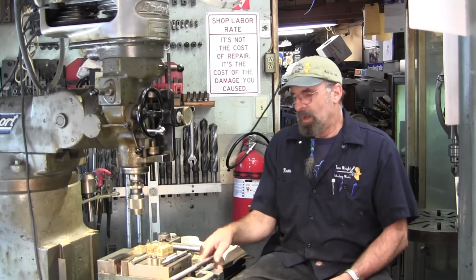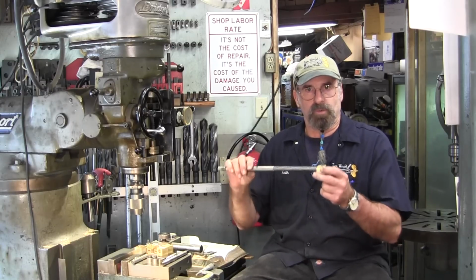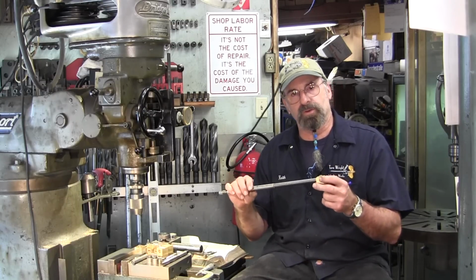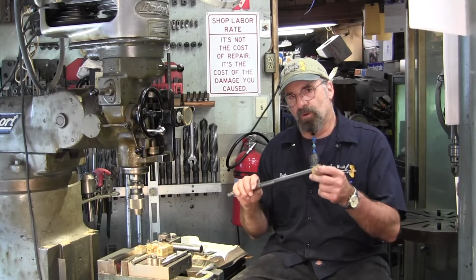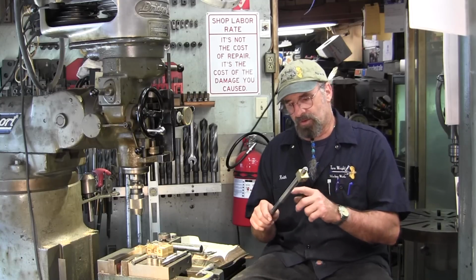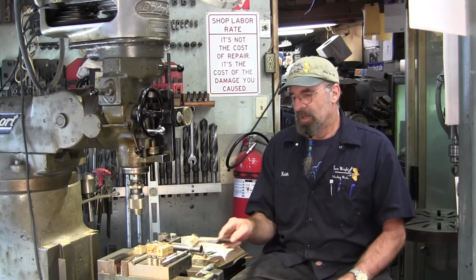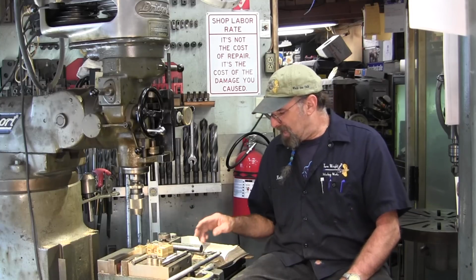Now, of course, when you're making nuts and lead screws, that's why you do both together, and you turn your nuts first and use your nuts to gauge the thread. But here we are, trying to create a set of nuts that fit on this lead screw. And of course, this lead screw's root was a little less than what was expected when we started.